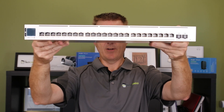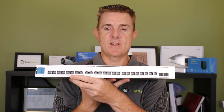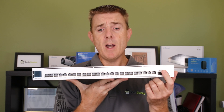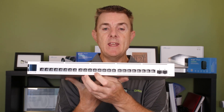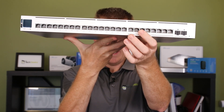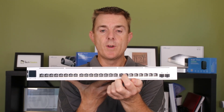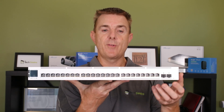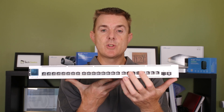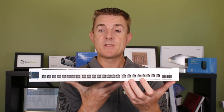Then you're actually going to get the device itself. So let me just hold that up so you can get a nice clear view. This is the 24 port version. Up this end we've got two 10 gig SFP ports, and then we've got 24 ports in total all the way across. You can see there's a white panel at the back of each one of these — I'll add some power in a moment so you can see what it looks like. Traditionally the link lights are in the top corners of each socket, but these are now shined from the back and can be any colour you want. We've got our two 10 gig SFPs, then eight 2.5 gigabit per second ports, and these are PoE plus plus, so that's 60 watts a port.